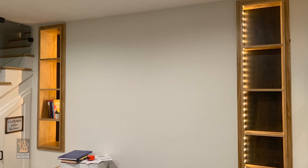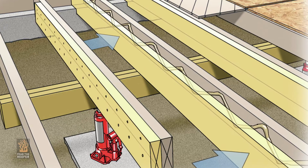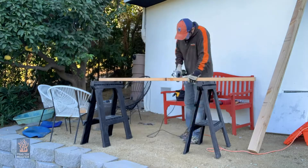That's a lot of weight. You've got to make sure it doesn't fall through the floor, and you also want to make sure your floor is strong enough to withstand regular household use — parties, friends — in addition to the full load of the 220-gallon aquarium. I'm putting the aquarium up against the load-bearing wall, which is a good place to start. However, I still need to reinforce the joists. The engineer said we needed to reinforce the floor by using sister joists.